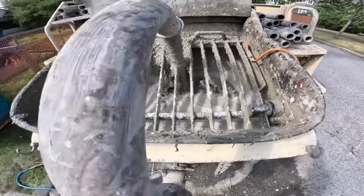All right, so just to summarize: Dawn dish soap, or just dish detergent in general, for killing hot mud in the hopper while traveling - absolutely awesome. The thing I like best about it is it doesn't segregate the concrete like excessive amounts of water, or even using sugar or a lot of other retardant products does. So when you get to the washout area, the concrete's almost in a half-melted milkshake type of state if that makes any sense - way easier to wash out, way easier to get the valve moving, way easier to get the agitator spinning again. Just an easier washout, absolutely 100%, I'm sold on this. I've been hearing about this for years, for decades, and this is the first time I ever tried it. I wish I'd come to this and given it a try sooner - but definitely will be something I'm going to utilize moving forward. Dish soap for the win, two thumbs up, 100% - give it a try, highly highly highly recommend it. Keep on pumping.